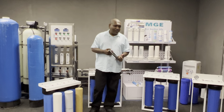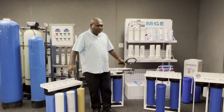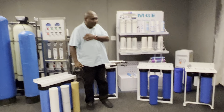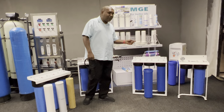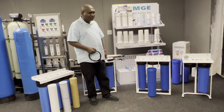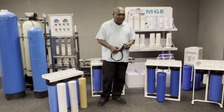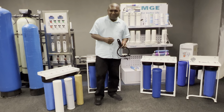To summarize: we call this our whole house systems — we have a two-stage and a three-stage. On the pressure gauge: when filters get clogged, the pressure actually goes up, not down, because the water is struggling to get through. No more questions for now — we'll share this video with all our staff to save repeating the same information.